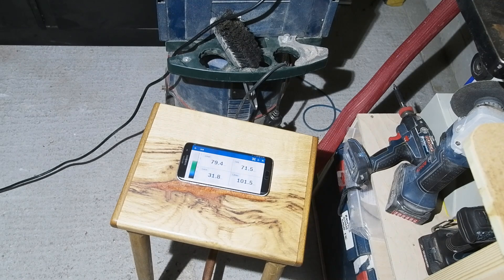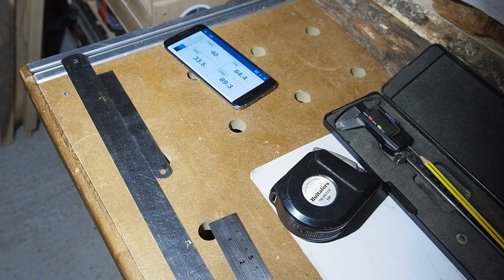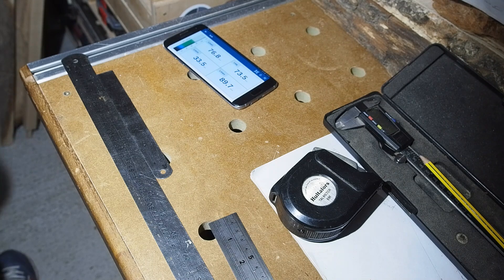With both machines running we read around 79dB. Back on the bench — should have kept it on the stall really as it's now a bit further from the extractor — but anyway here I'll measure the extra noise from the machine when cutting. A piece of 120mm wide oak was the victim. I'd call that about 79 to 80dB. That's pretty quiet — this makes it easily the quietest planer in my workshop.